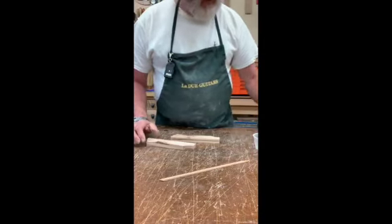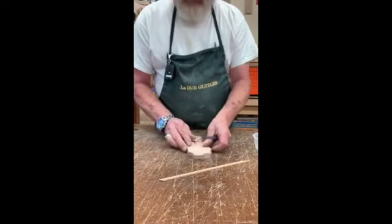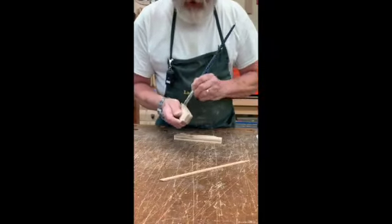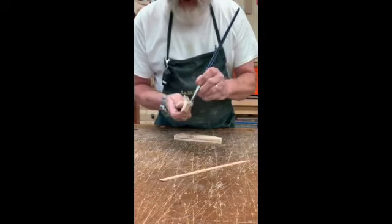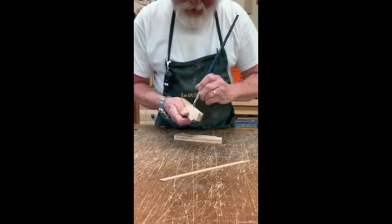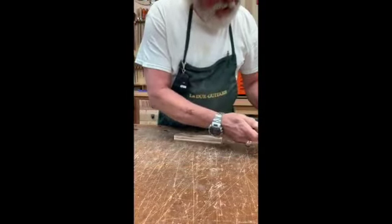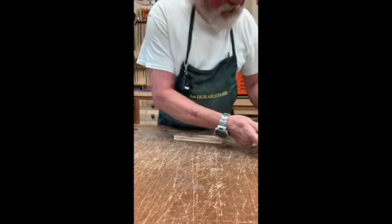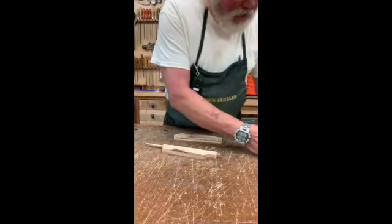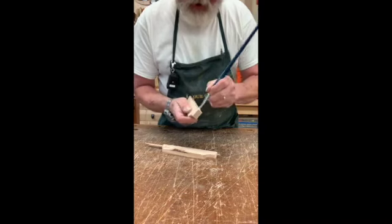I put the glue in a cup, and I'm going to use a brush because the way to keep these from spreading or moving beyond one another, passing each other, is, I think, to not use too much glue. Too much glue is just not a good thing. It lubricates the joint, things start to squeeze by each other, and it always happens, especially when you're not looking, and you get really embarrassing results. So I'm just painting a thin coat of glue on there, installing my spline, and I'm going to put more glue over the spline itself. Not too much. And I'm going to apply glue to the opposite side as well. Both surfaces, always a good idea.